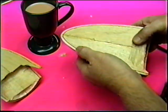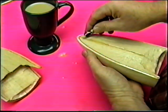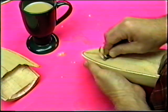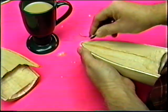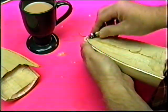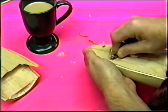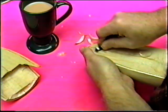Now I just sketched out a line where I thought, and it's certainly an oversized line, where I would start this hollowing from, and there's really just no substitute at all. I try to do most of it, if possible, with the gouge, or some of it, because it keeps the dust in the house down, and that's a significant benefit for Karen, not to have to deal with the dust.